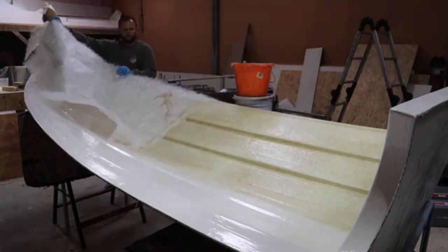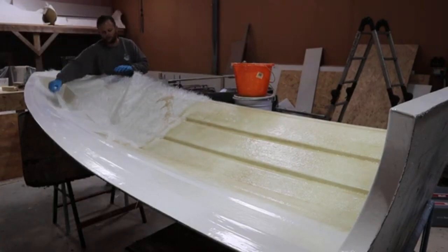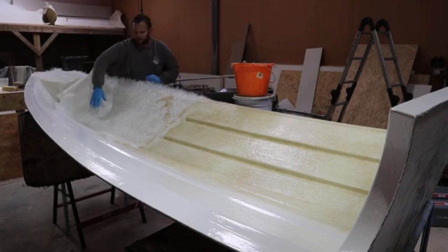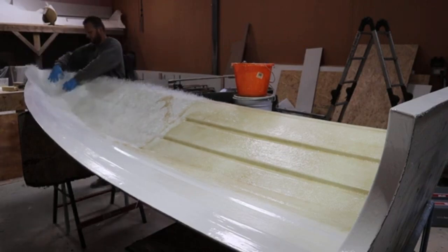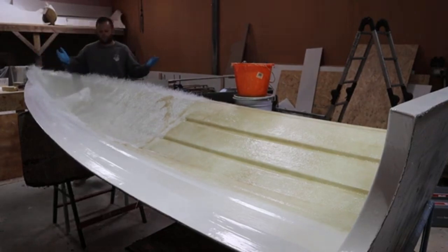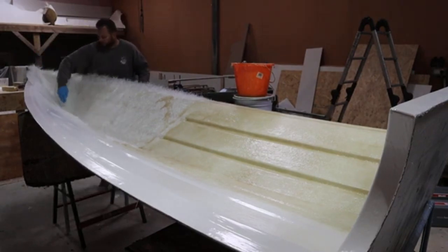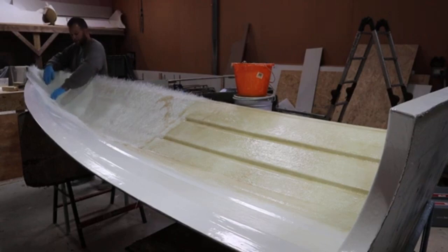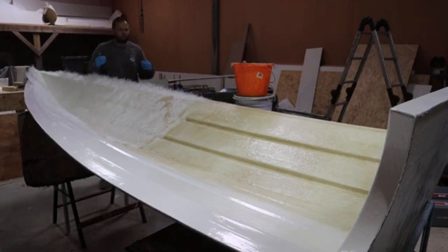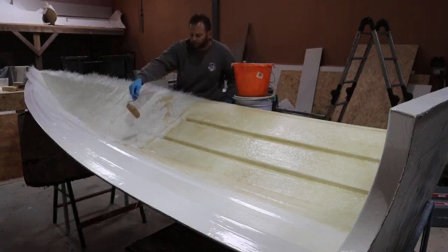So that's it, that one's wet, so we'll fold that back in. Now we've got these little folds again, okay, so that will tuck in there nicely into the keel, nice and flat. Fold that down there, see, and then it sits exactly where I wanted it to in the first place. So I'll put out my layers again there and tuck them in. If you tuck them in and situate them into these deep pockets, like this stem, then it's not going to be stretching and making it thinner, like we said with the chines on the sides as well, okay.